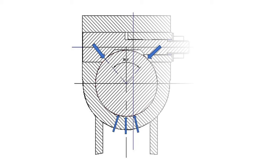The consequence of that is that there's an upward load on the cotter. On the left-hand side, that's fairly straightforward since it's solid. But on the right-hand side, it comprises a ring with an inner bolt. And since that ring is a little bit on the thin side, there was a possibility of it squashing. So for that reason, I included a land, shown here, which enables the load to transfer directly through the inner component to the top and then into the casting.